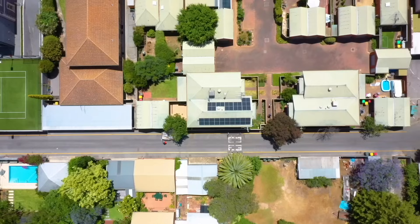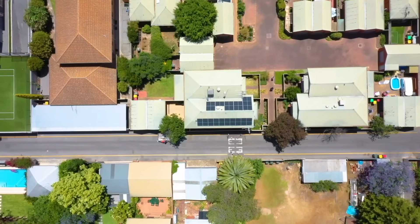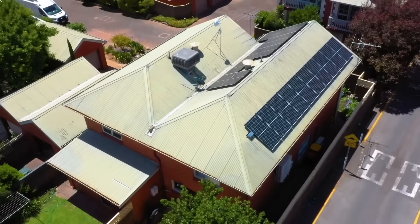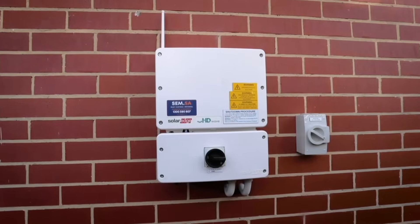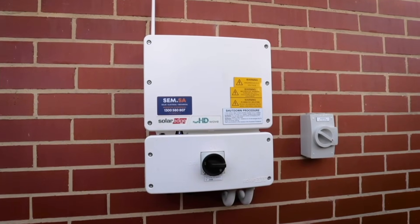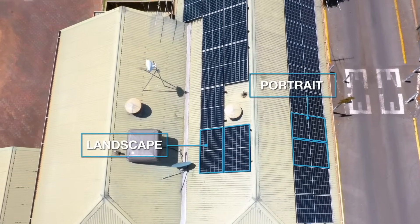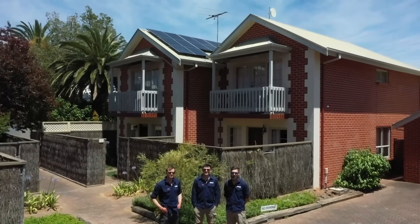It's the end of a long day but finally we've got the 6.6 kilowatts installed and it's all working beautifully. The owner Jono can look forward to decades of low bills. The reason this was quite an involved install: first, it's a townhouse so there are access issues with narrow lanes; second, it's two-story so that means more involved work especially to do it safely; third, the guys put an enormous effort into concealing the cables in the cavities instead of ugly cable runs on the outside of the brick; and fourth, because of obstructions on the roof, the guys decided to lay panels landscape on half the roof and portrait on the other half, which adds quite a lot of work. But the guys are very efficient, know what they're doing, and really wanted to do the best install possible — they've done a great job.